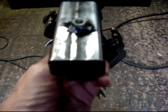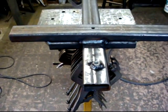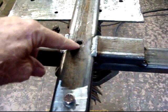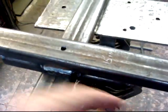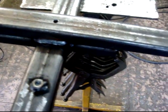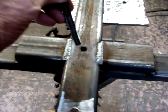You can slide the bolt in there, screw it in place, and that will hold the coupler. On this hole I drilled it all the way through at 5/16, then turned it over and drilled this hole out to 3/8. On the top I threaded this portion and the lower portion 3/8-inch by 16, so that will let me screw my center bolt in.